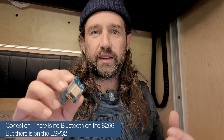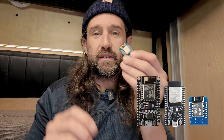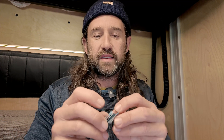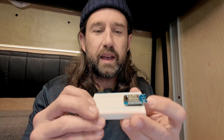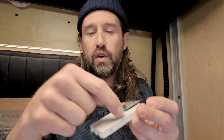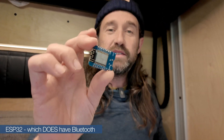These devices come in a bunch of form factors. Anybody can take the design for this ESP chip and put it on a development board, and what's nice is these often come with header pins that allow you to put it in a breadboard. You can plug it into USB for the initial programming, then take the pins and jump them with jumper cables over to devices you're trying to test, like sensors or lights. There's a newer big brother to this called the ESP32 — a dual core processor with more RAM and more GPIO — but this is totally capable for most applications in Home Assistant, especially if we're just turning relays off and on.